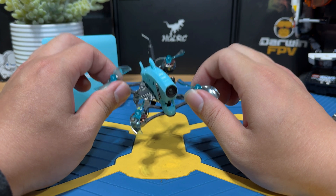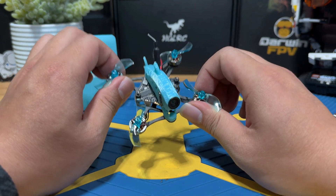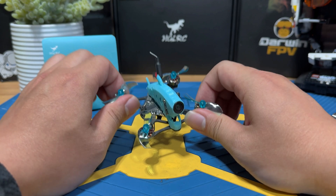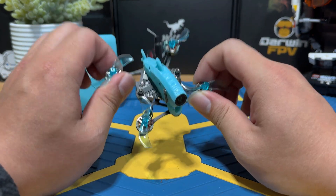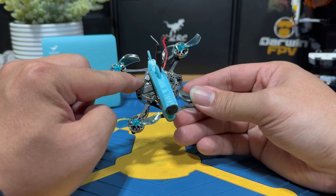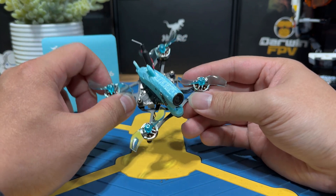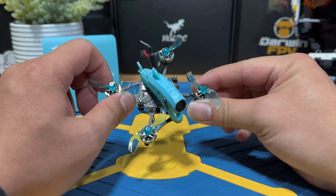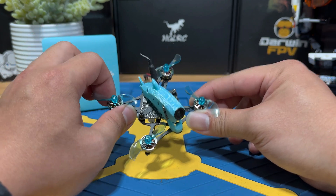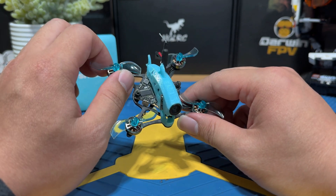Before we begin, let's briefly introduce the basic requirements for ExpressLRS equipment to bind together. You are required to have the same ExpressLRS firmware on both your radio and your drone — they have to both be on 2.X or both on 3.X. The Drag Shark comes with an SPI-based ELRS receiver, meaning the ExpressLRS RX is baked into the flight controller AIO, and all firmware updates are managed strictly by Betaflight. The Drag Shark ships with Betaflight 4.4, which means it's ExpressLRS 3.X, so your radio must also be on ExpressLRS 3.X. If you're unsure, check the link below for a detailed guide.